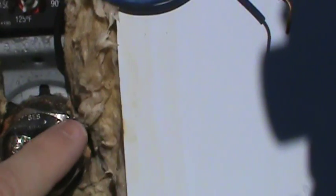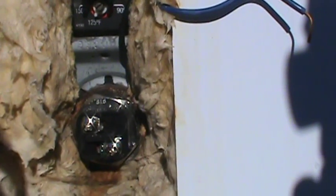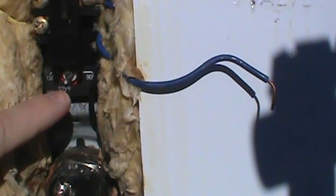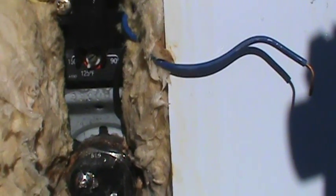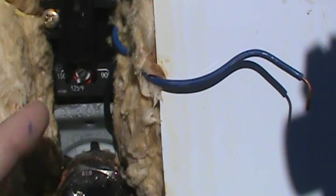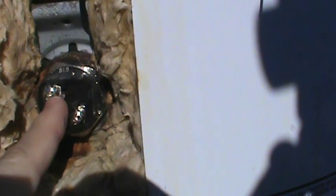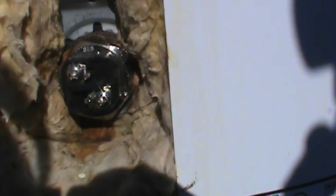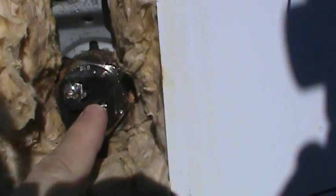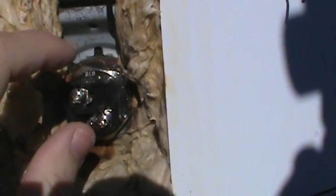This common will go straight to the element itself. If it's wired like that in your wiring diagram, you can still use the temperature adjustment knob and it will power itself via DC. That is one way to still recoup the temperature adjustment knob so you can set the water temperature the way that you want it — not scalding hot or not hot enough. I'll unthread this and show you how to put in the other one.